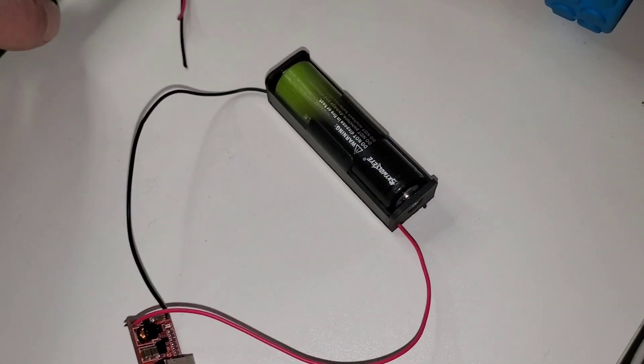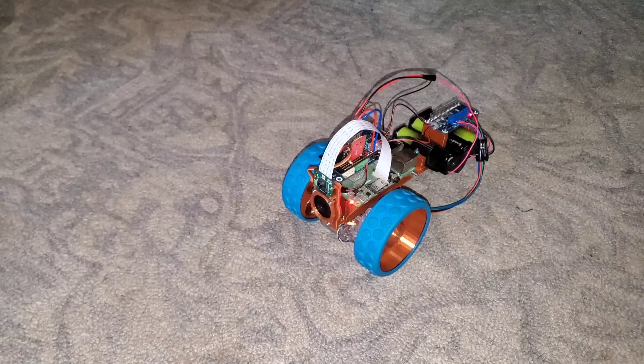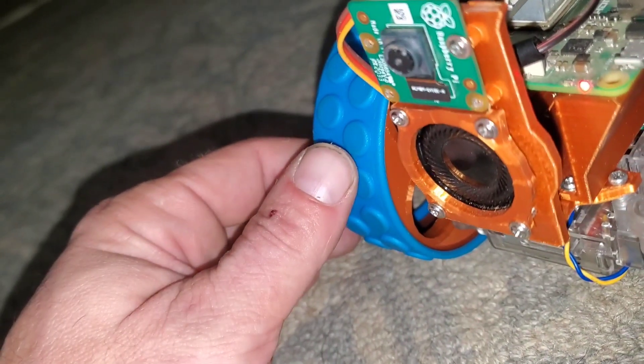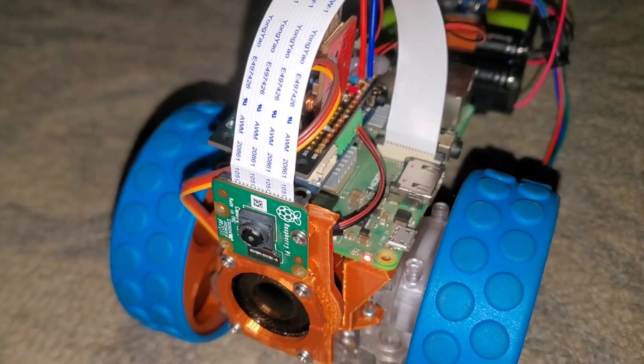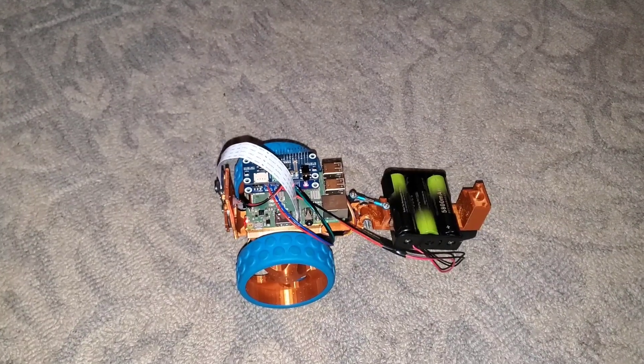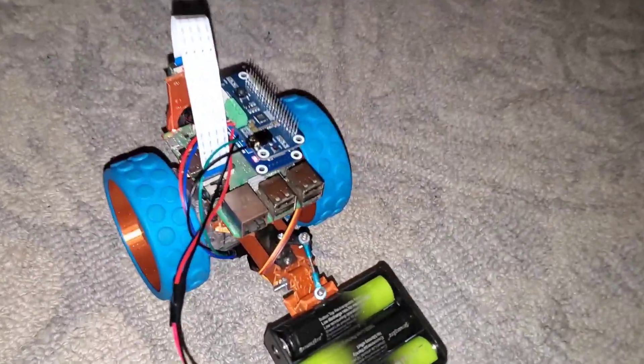Let's try having two sets of batteries — one for the Pi and another for the motors. It's not doing anything. Let's try three batteries instead of separate batteries, so that even once the motors draw the voltage down, it'll theoretically stay above the voltage needed for the 5-volt regulator. Well, that's a little bit of progress, but the pulsing is really weird. I think I'm sick of trying to use this motor controller.